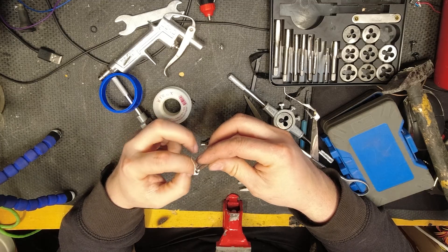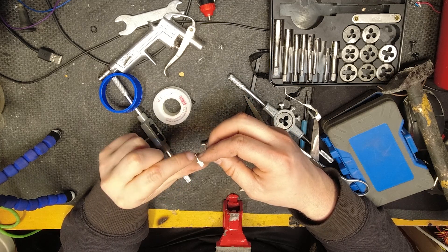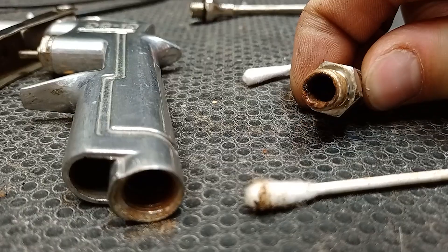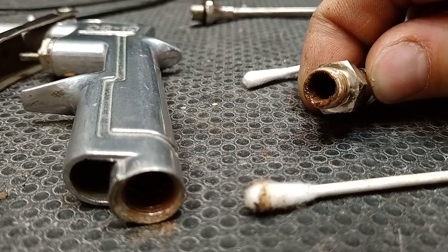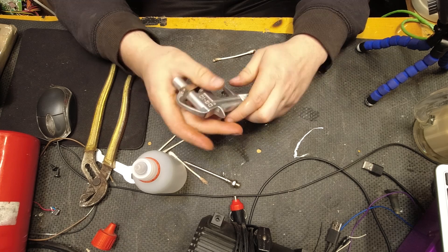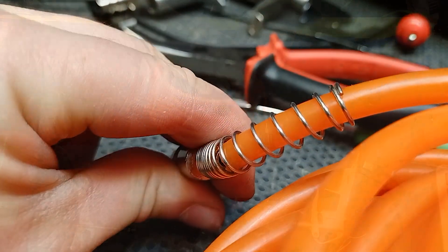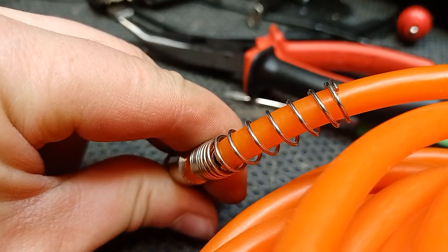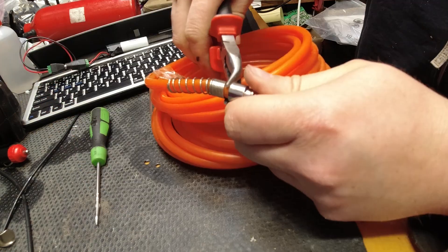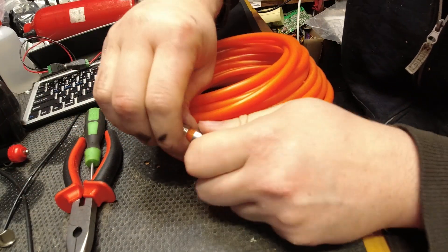I have had this air blow gun sitting for a long time, and for that reason I cleaned it inside because it had started to oxidize. I cleaned the top and bottom end and lubricated it with oil for pneumatic tools. The only thing I was still missing was a longer hose. I had one saved because I hoped it could be repaired — it is broken at the end. Since I could see the end is metal, I decided to take it apart, cut off the damaged hose, and put it back together.